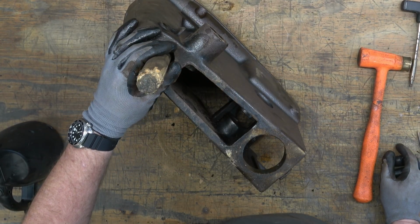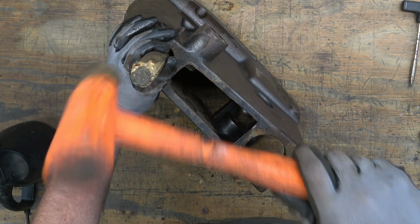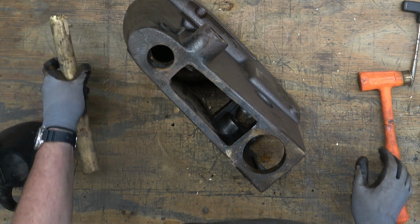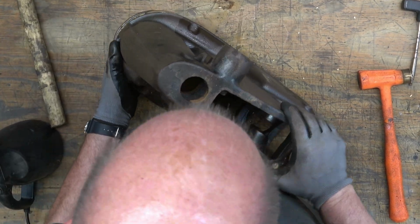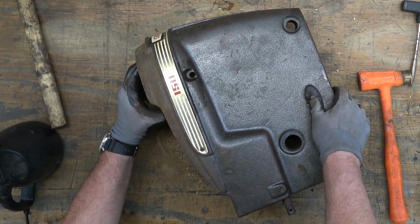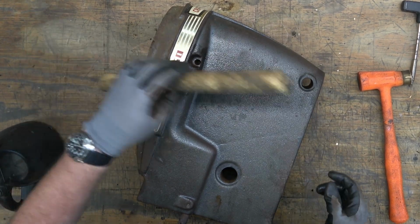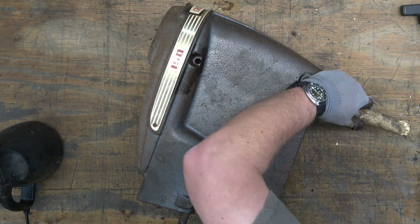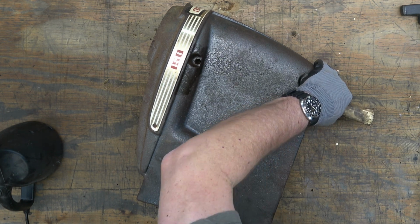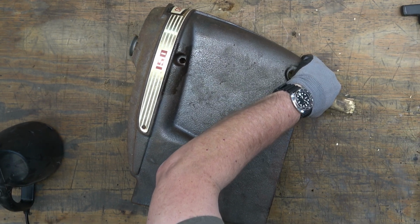Next, we can go ahead and drive the spindle pulley assembly out. So I'm just using a wooden dowel here on the bottom of the spindle insert part of the spindle pulley assembly. And it's got two bearings on it, and you'll see that in that other video. And I've got the first bearing out, so now I'm just lining up the second bearing with the top bore, and then we're going to continue to drive it out of there. And you'll see it pop out on the left side of the head here. There it goes.